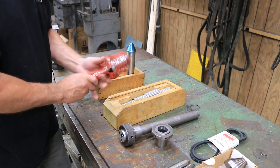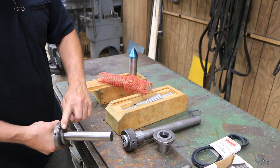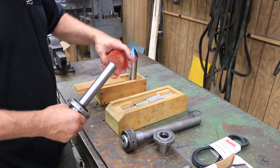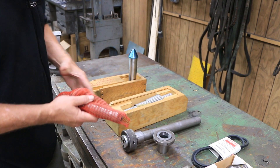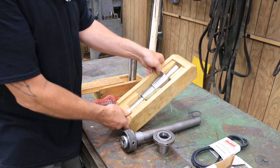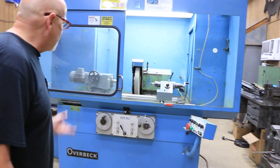You also have a test bar with a Morse Taper number 5 to go into the headstock — you can indicate on this to get it exactly straight. The manufacturer includes one of these with the machine. It's useful if you need to find true zero or if you ever need to regrind the base of the headstock. There's also a balancing arbor so you can balance the grinding wheel, which is important on a wheel this size. An extra set of belts for the work head is included as well.